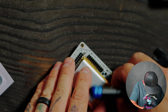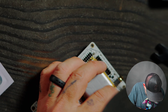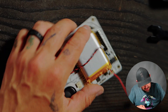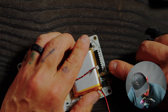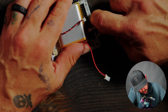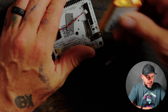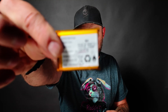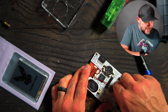First and foremost, let's go ahead and unplug the battery from the connector here. You want to disconnect the battery that way, in case you start prying up on something gently — like this double-sided tape here. I'm going to do my best not to apply any pressure to the actual board down below and just lift up from the battery itself. There we go. This is the stock H4M battery, and I will show you the Rabbit Labs battery when we get to that portion. It's just held on by two little pieces of 3M double-sided tape.